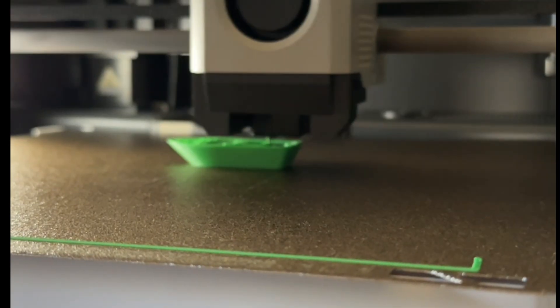Just before I show you my first print on this machine, I want to address an important point with the textured base plate. Before I printed anything, I took it out and gave it a slight wash with some washing up liquid and warm water. After drying it and putting it in, my first attempt at doing a benchy didn't come out very well — it did not stick to the plate and created some spaghetti. So I took the base plate out and gave it another wash using quite a bit more washing up liquid, dried it, and put it back.